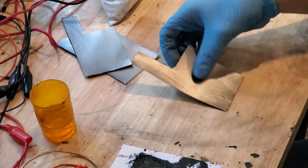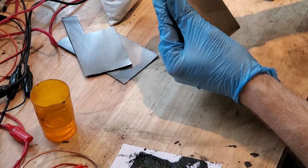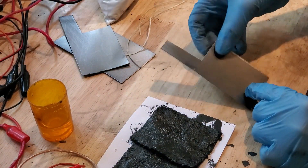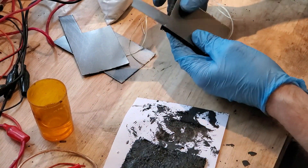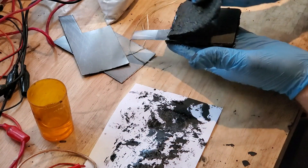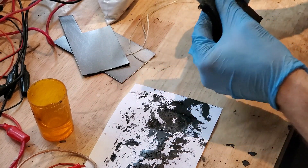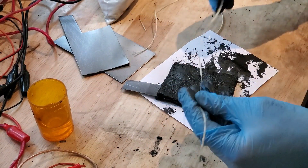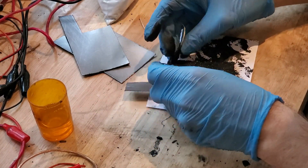Once that's done, grab your graphite foil plate and wrap scotch tape around the base of the leads of all your foils. Graphite foil is very weak, so doing this should help protect it. It's time to connect the positive current collector. Sandwich the graphite foil between the two carbon felts. Then use three pieces of yarn to tie the carbon felts in place.